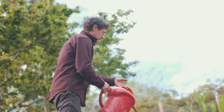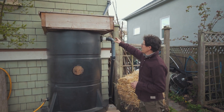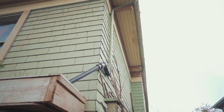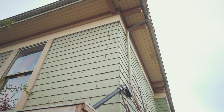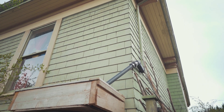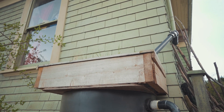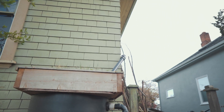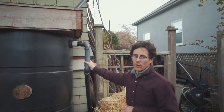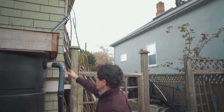You can see we're about two and a half feet up, so we probably have about one psi — not very much, but enough to fill a water container. With this tank we have the foundation built up, then the inflow coming in up top. We cut into an old two-inch aluminum pipe coming off the roof and switched over to ABS pipe — the black pipe here. An important consideration: always match your overflow size to your intake. Here we have a two-inch pipe, so we cannot have less than a two-inch overflow, because in a big storm you don't want the tank overflowing.